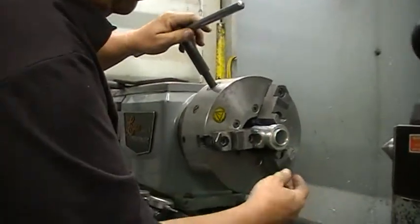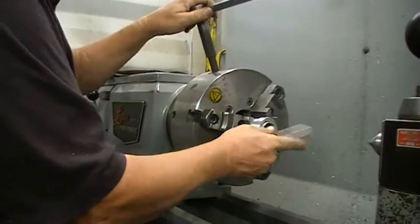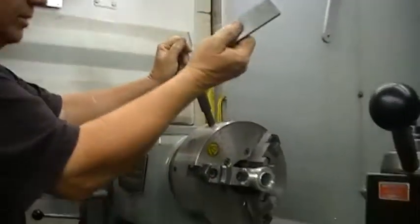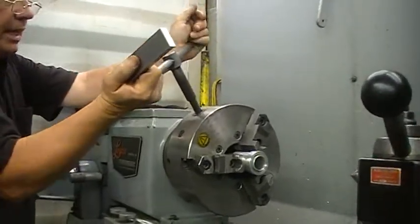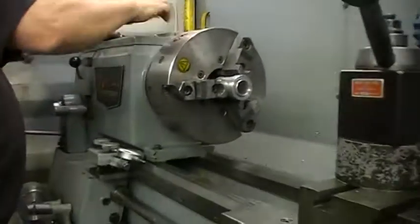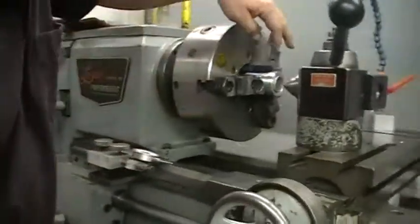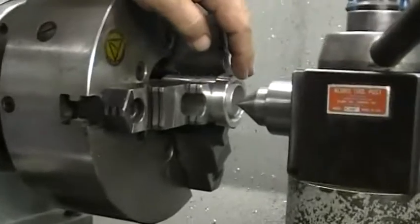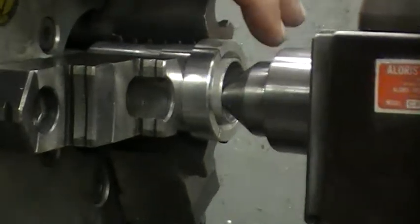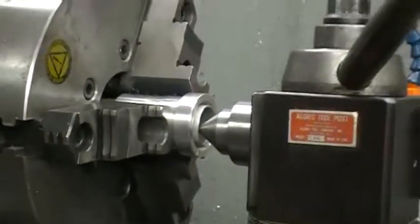Now you see we index it around so each one of the three jaws goes on one of the three fingers there. We'll tighten that down and get that out to the right distance. Stick it out just a little bit too far — tap that back some — there, about right there. Tighten that down real good and tight; we certainly don't want it to move. Now we're not going to run the lathe real fast because it's just not that important. You bring it around and see it comes around like this. We let that cone go up on the edge right there. Now these are both at 37 degrees, so it just takes that edge and rolls it right back over.